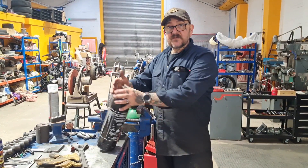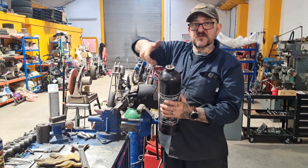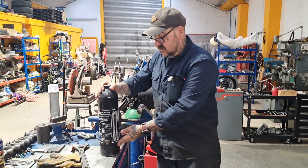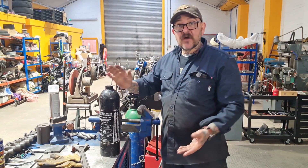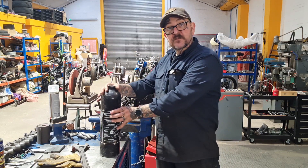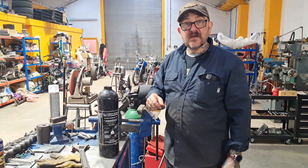So we're going to make an oil tank from this fire extinguisher. I've managed to wrestle the top nozzle spray out of it and I'm going to try and get it in the bandsaw, chop it down to the right width, weld the two halves together, weld some fittings in, smooth off this big spouty nipple bit where the gland and the thing went in, and go from there.